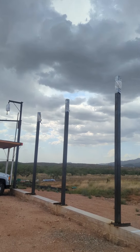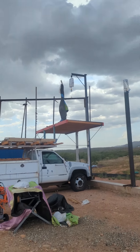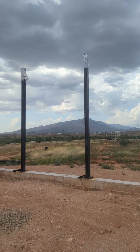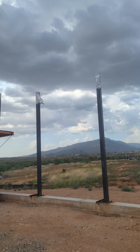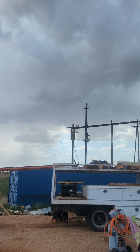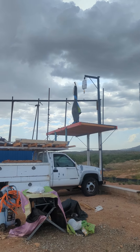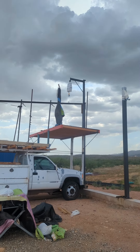The reason I went with these is because this is a post frame construction build, just done a little differently. A lot of times with post frame construction they bury the wood poles directly in the ground — like a pole barn. I decided I didn't want to go with wood posts because I was doing some reading and people were saying that over time the trusses would actually pull on the posts and the wood would start sagging. So I decided I'm just going to go with a steel frame and go that route.